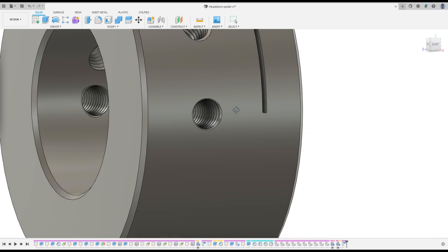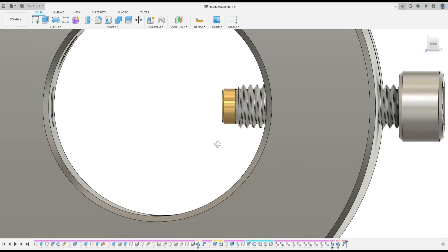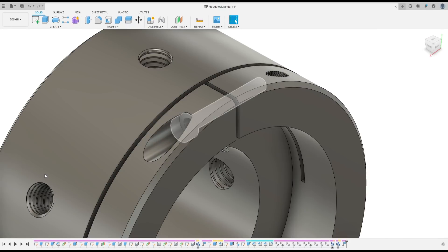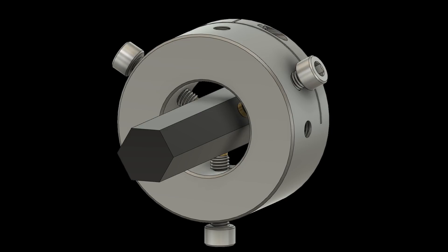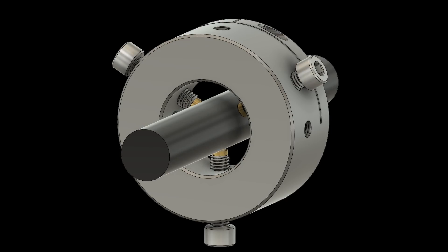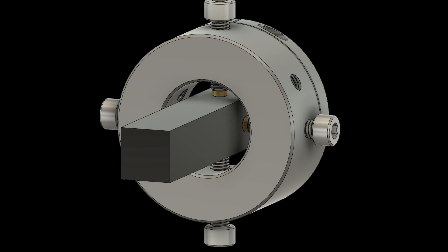The conversion needs three additional M8 threaded holes. The spider clamps onto the back end of the headstock spindle tube using an M3 clamp screw in a partially separated ring of material cut using a slitting saw. That can remain unchanged. The new setup can still be used as before using three screws. I'll need to make one extra brass-tipped lock screw.